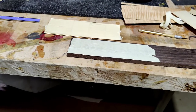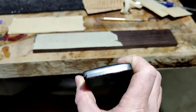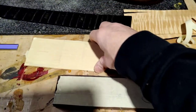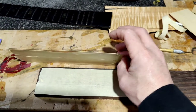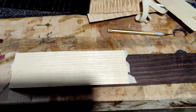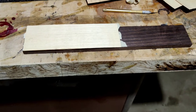I had to run this through the planer after milling down a smaller board, and I realized that the original fretboard had a taper to it from about 10 millimeters at the very base to about 6-7 millimeters at the top. So I'm creating this faux stepped ramp out of some veneers that tapers from 2 millimeters down to nothing, so that hopefully I can mimic the gradual slant in my planer to give that effect all the way across, before I eventually put the radius on the fretboard.